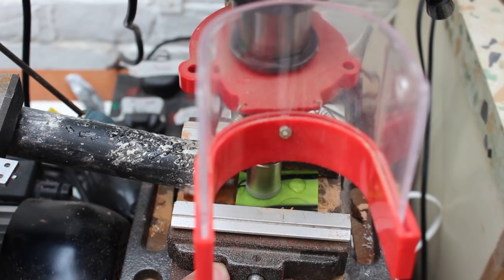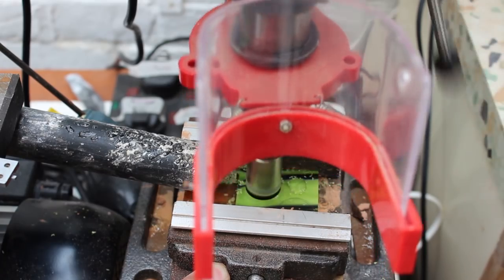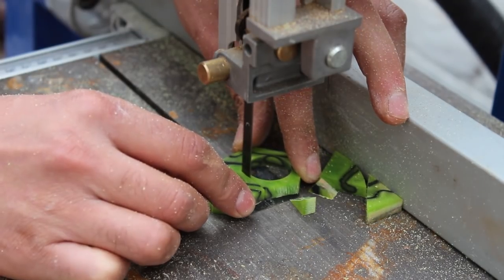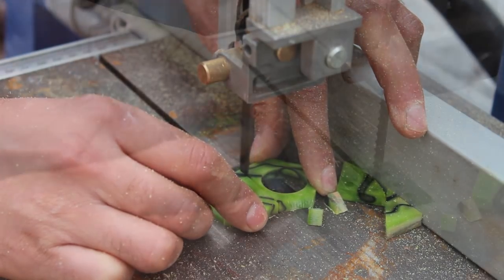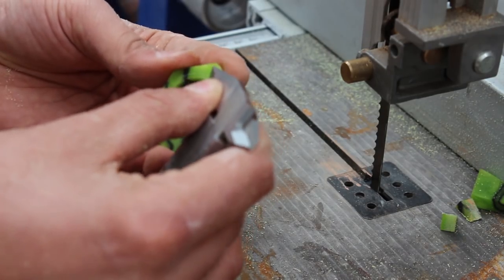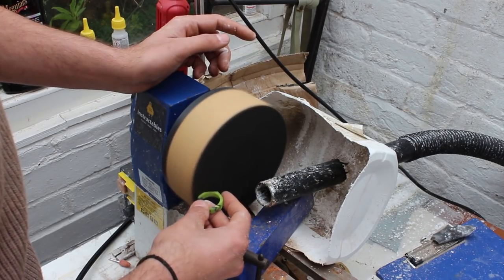By far the easiest part of this project was creating the acrylic elements of the ring. I used the same diamond drill bit to bore a hole from the acrylic block, and then just roughed out the ring on the bandsaw, being careful not to rough out my fingers in the process. To get an idea of my ring shape, I set my calipers to 3mm and scored a line using the inside diameter of the hole as a guide.